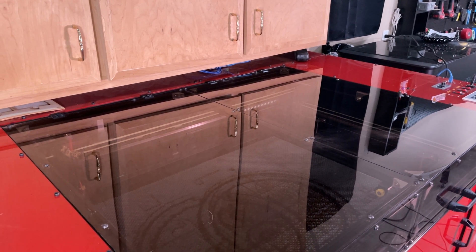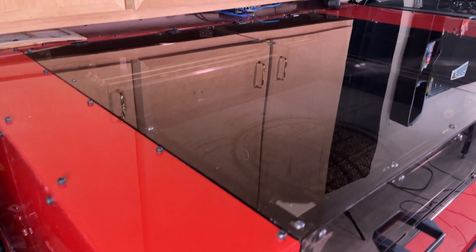The SP3624 DIY laser project is up and running. I've actually used it for a couple of commercial projects already. There are a couple of things I didn't talk about much in previous videos. The first one is the outer shell — the skin of the laser. When you build this, what you end up with is an aluminum frame with a laser tube in it, and that's unsafe and will also prevent you from safely evacuating fumes from your projects to the outside. So you need to put some skin on the laser. What I used was clear acrylic — clear because it's cheaper than colored. I cut all the pieces out on this laser, rolling it over to the garage door of my shop, opening it up, and cutting with good ventilation. As I cut them I painted the inside, and when it was dry I mounted them on the laser, eventually getting the cabinet closed in.